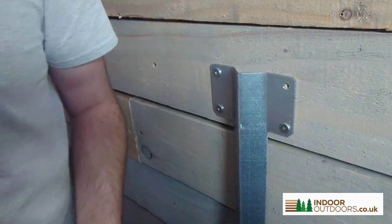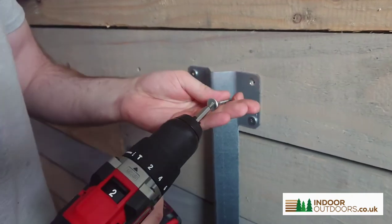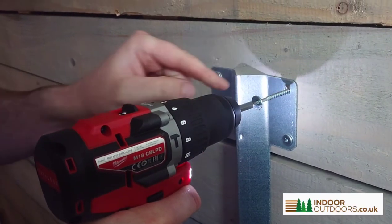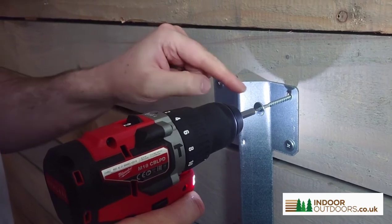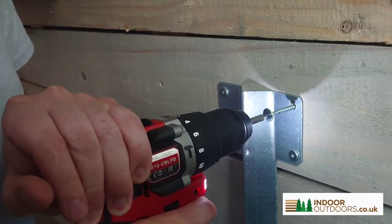I'm going to quickly install one now so you can see. Each pack comes with a square drive bit that slots in there wonderfully. You start it in like this, set the torque setting, apply some pressure to keep it in the square drive, and then you can go pretty much full speed.